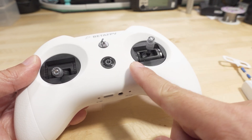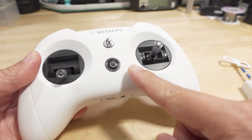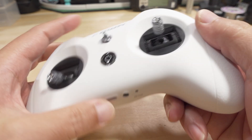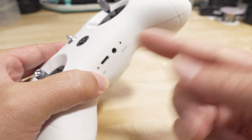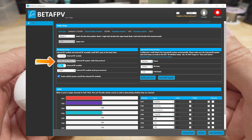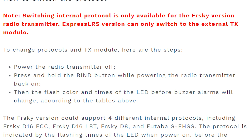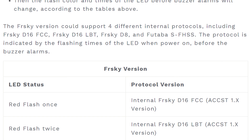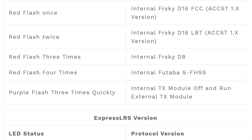In terms of configuration and setup, this radio uses the BetaFPV configurator — I did a tutorial video on that and I'll link it in the description. There's no OpenTX, no screen — it's very simple. You have to have either the internal module or the external module turned on, and you switch between them via the configurator when plugged into your computer. If you want to switch in the field, you'd need a laptop — there's no phone version of the BetaFPV configurator yet. There is a way to switch on the fly mentioned in the manual, and I'll put a screenshot on screen if I remember.